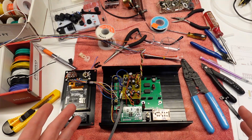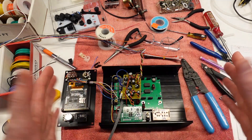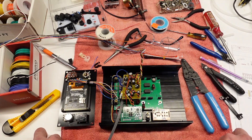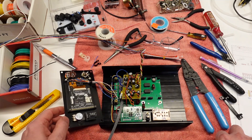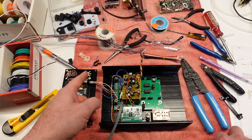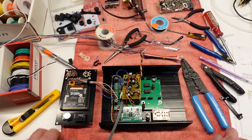This is where I am after about three to four hours of work. It may not look like I've accomplished much — some of the time I spent just thinking about how to route and secure the wires for the display. There's no immediately obvious elegant way to do this, mostly because I want the front panel to be able to lay down flat for service, but when I fold it back up it has to neatly collapse in the available space. A jacketed cable or spiral loom just wasn't going to work — it would be too stiff and wouldn't fold neatly.